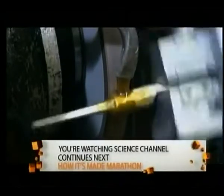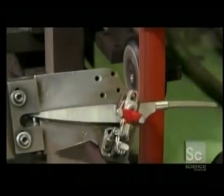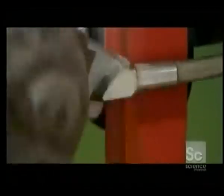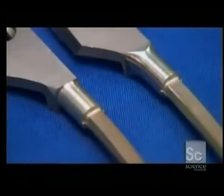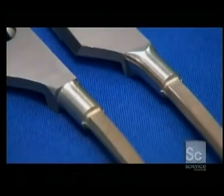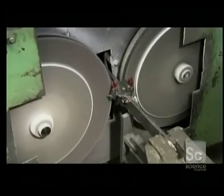A grinder shapes the round area next to the tang — the term for the metal core of the handle. With a sanding belt, they smooth out and blend the adjacent corners. Then two polishing wheels give the surface an upscale satin finish.